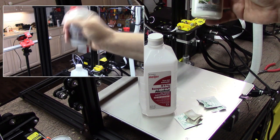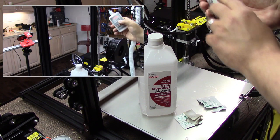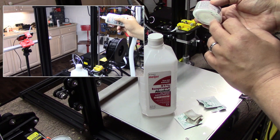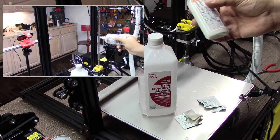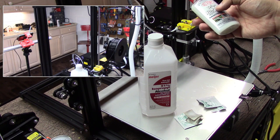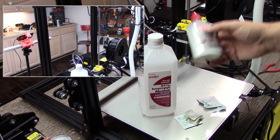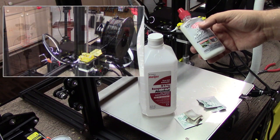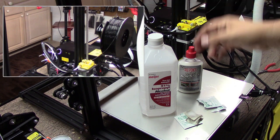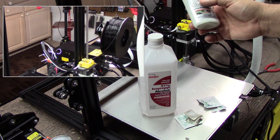One of the things you have to make sure you do is shake it up. It will want to settle to the bottom. It should be a milky white color — that's appropriate. Even just sitting here it's started to settle a little, so you want to shake it vigorously. It does have something like a lighter fluid type base. It is flammable, so you need to be careful. But when you put this on, it eventually dries and creates a Teflon film on the rod itself. The lighter fluid is more of a transport carrier.